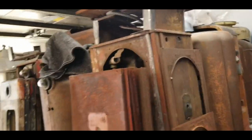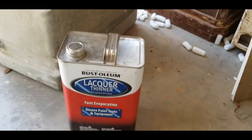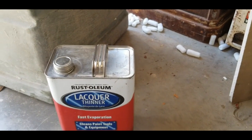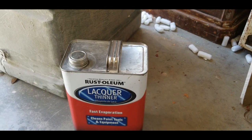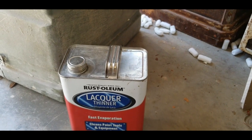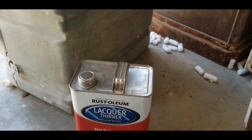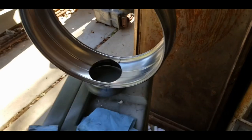So I'll take you through here. Of course, the garage has got a bunch of stuff. But anyways, I like to clean my stuff at the beginning with some lacquer thinner. One thing that's good about lacquer thinner, it evaporates quick. It's a quick solvent also, so it'll break down everything you need to. And don't get that on some nice paint, because even though it breaks down quick and dries quick, it'll still ruin some stuff.